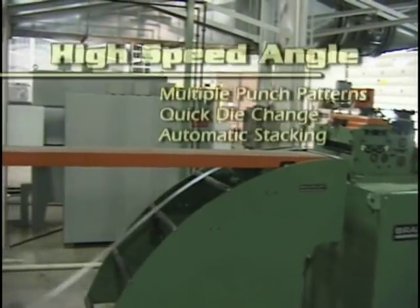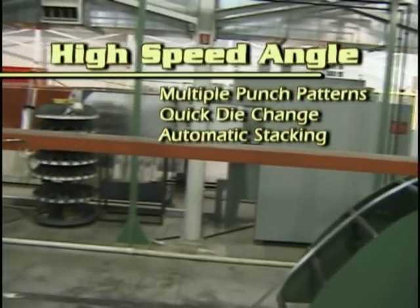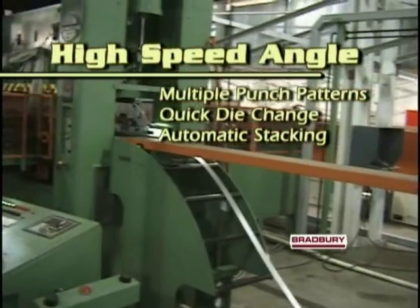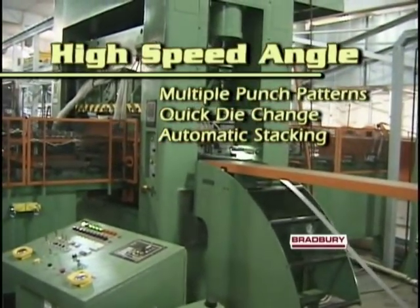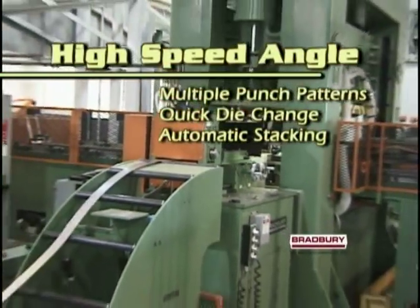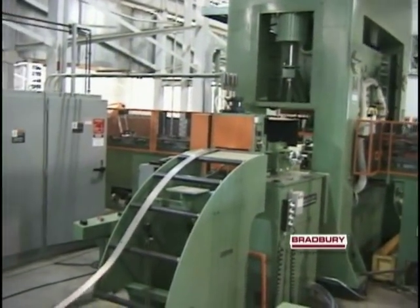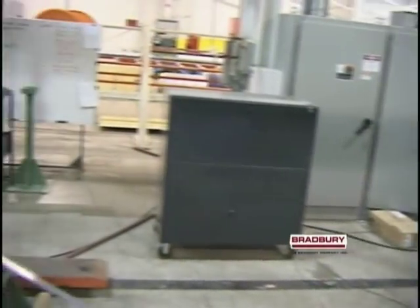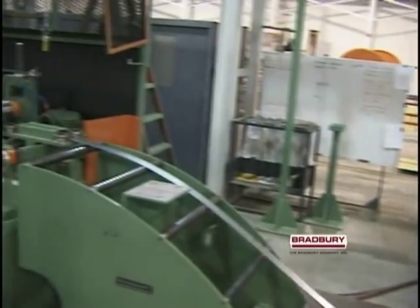This Bradbury system punches and forms 90-degree angle sections at speeds up to 200 feet per minute. The 3 die sets mounted in this system contain 5 strip paths. The desired path is aligned using driven carriage plates. The selected die is accurately positioned and locked in place with automatic pin locators and hydraulic die clamps.